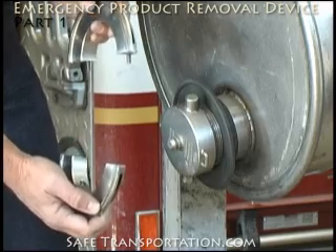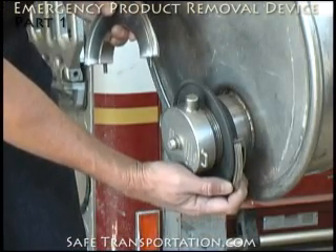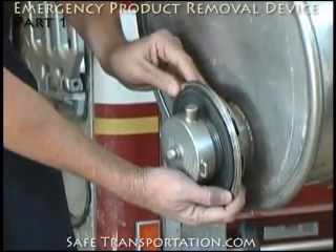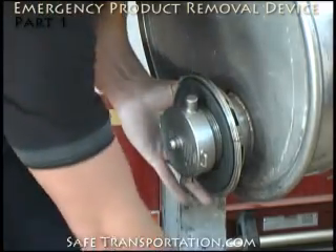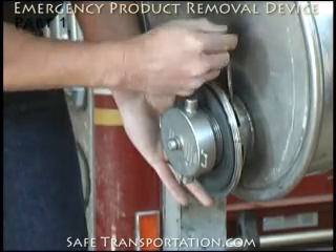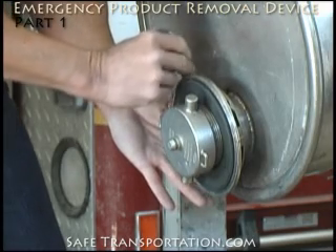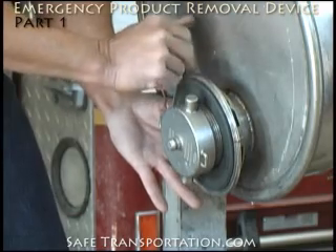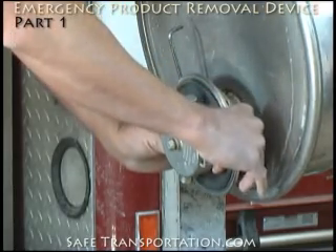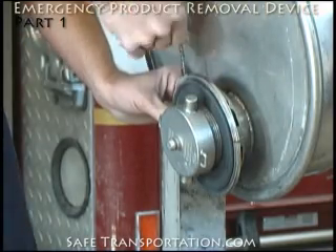Once you're at the point of assembling with these two halves, the important part is to put the bottom on first, and what you want to do is very gingerly slide it up in there. It will marry up with the gasket nicely and give you a nice line-up with the top part of the half. Once you drop it in there, those screws generally nicely marry up, and then it's the point of just taking an Allen wrench and starting to secure them. Don't tighten these down all the way — just kind of get them on for right now. We're going to do a little bit of adjusting. As they're coming together, stop and inspect to make sure that the gasket is nice and flat inside. If it's not, you can still push it in with your fingers to make sure it is nice and even. Once you've established it is even and exactly where you want it, then tighten this down further.